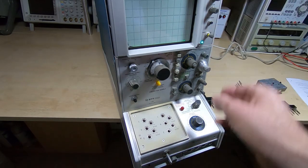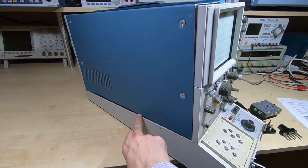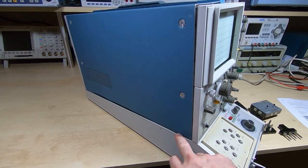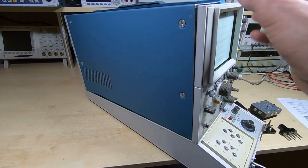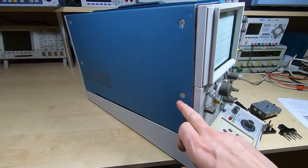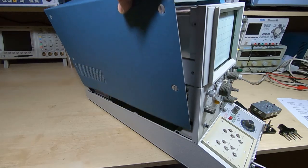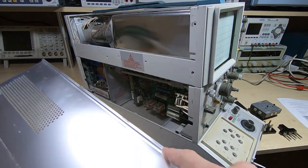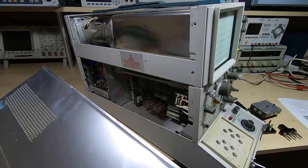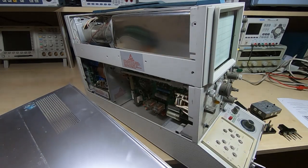One thing I did notice with this machine — let me turn it sideways. When I received it, it didn't fit very well down here on one side, while the other side was fine. I've realized that somebody was confused about how these covers are fitted. The way to remove them is: you've got quarter-turn fittings, you turn them 90 degrees anti-clockwise to disengage them, then pull the top edge forward and it will lift out. I think someone was trying to get the bottom out first and, looking at the marks left on the panel, they were using a screwdriver to lever it out. That's done quite a bit of damage to this panel, so I'll need to try and straighten it out.